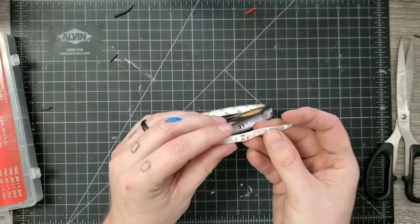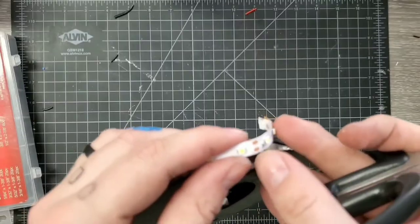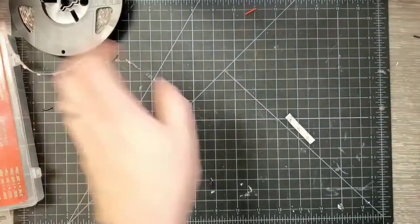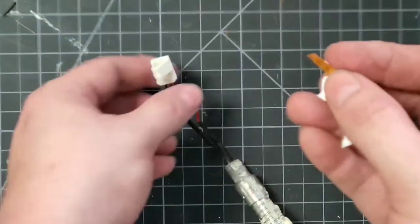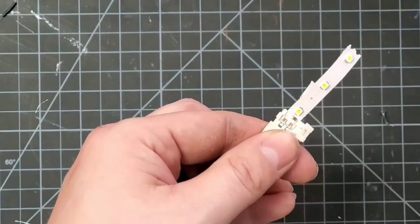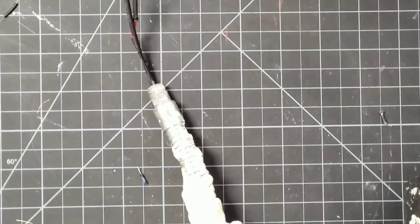Now that I'm back at school with all my proper recording equipment, I can show you how to take this roll of LEDs and hook it to the wiring harness. Step one: find the little line and cut off how many LEDs you want. The next step is to peel back the little sticker so you can make a good contact. Then slide the copper portion underneath the two pins in the connector, close it up, and you've joined the wonderful world of LED lighting.